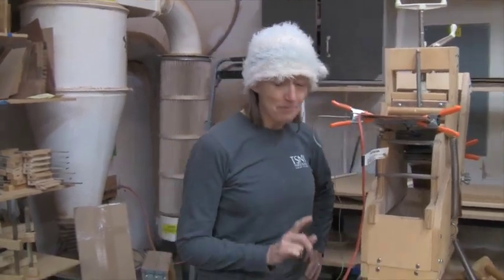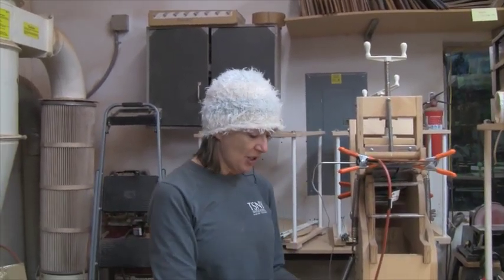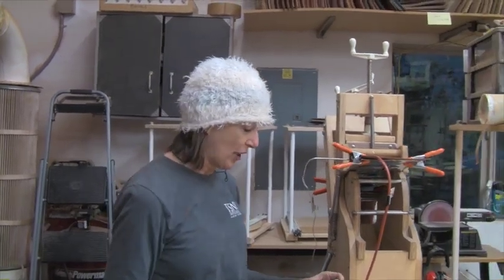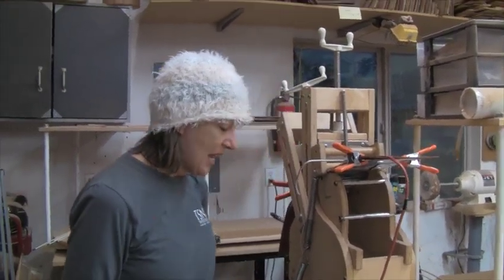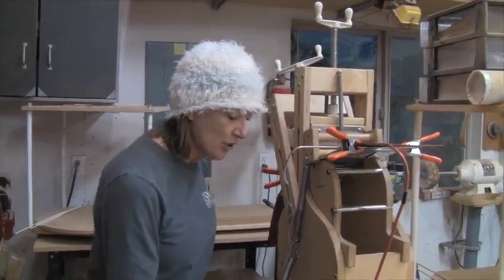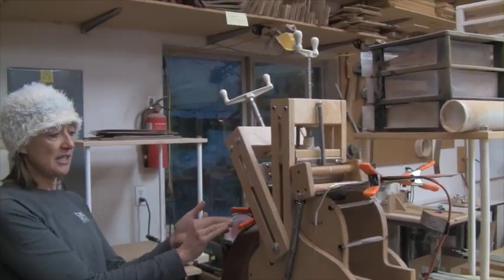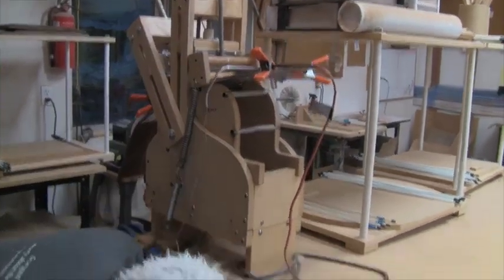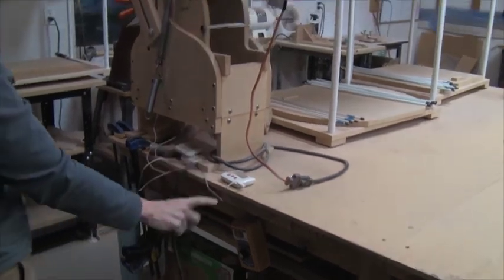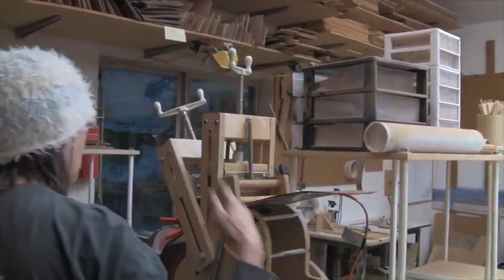We're back. My thermometer is going off because I have set it at 212 degrees, but as I said I'm going to actually take it to 230. I just want to be here right when it hits 230. It's at 222 right now. When it gets to 230, the first thing I'm going to do is bend the waist, and then I'm going to do the tightest part of the bend before I do the lower part. Now I'm at 230. I'm going to turn this down to about half heat so it doesn't keep going, and I'm going to remove my thermometer so that it doesn't beep at me again.